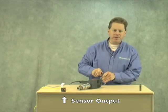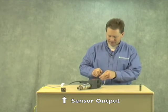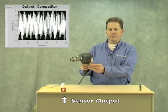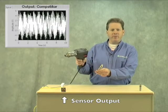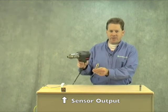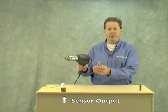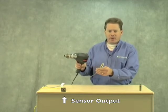Now let's take a look at the proximity sensor we saw in a recent demo with the 20mm sensing range. You can see the sensor is several inches away from the noise source, but you're getting a lot of flickering on that LED. That's because the sensor is sensing the electrical field generated by the coils inside here. You're going to get that same effect on the factory floor when you have motors, drives, and all sorts of noise sources.